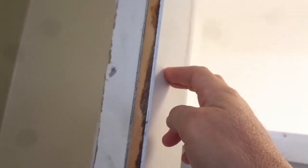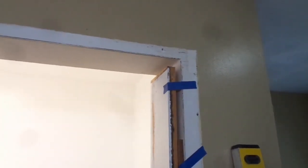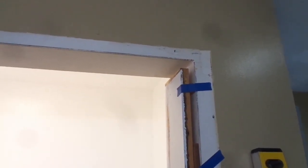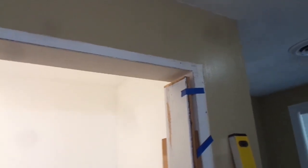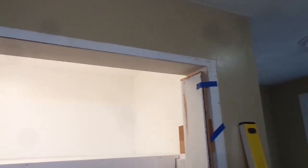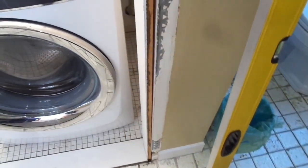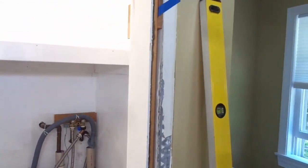I can get away with mounting this door frame exactly up against the plaster wall. When you measure from that corner over to here, instead of being 60 inches, it's 59 and 5 eighths. So I'm losing three-eighths of an inch on the opening. The two doors I purchased are exactly 30 inches wide, and you need an eighth of an inch or so all the way around each door, so I'll lose at least another three-eighths to a half inch for spacing. I think the easiest thing is to just trim the doors down a little bit. I could pick up some of that by removing the lower part of the wall here, cutting into the corner bead and the plaster — but that's a messy job just to pick up three-eighths of an inch, and I don't think it's worth it.